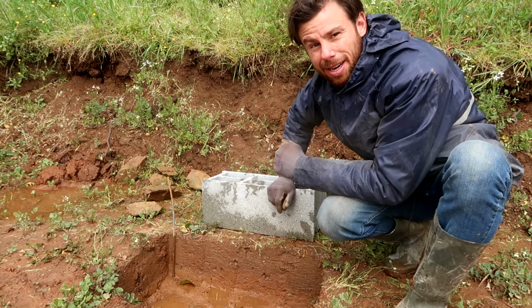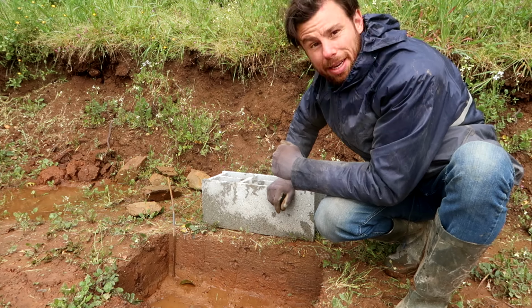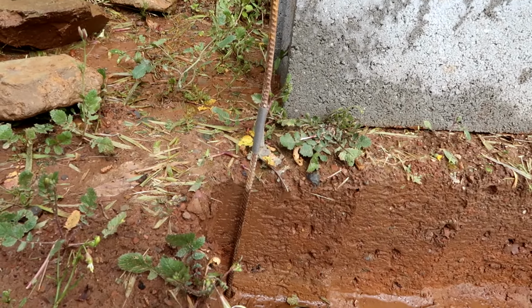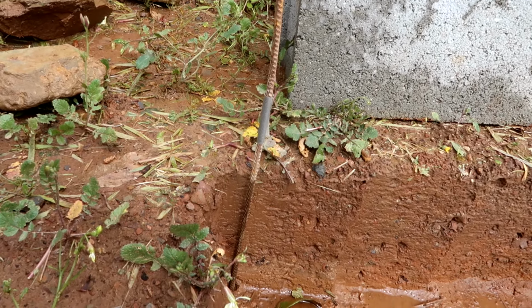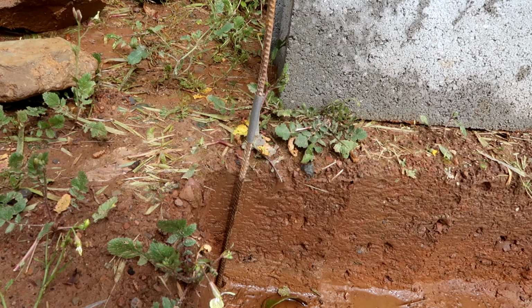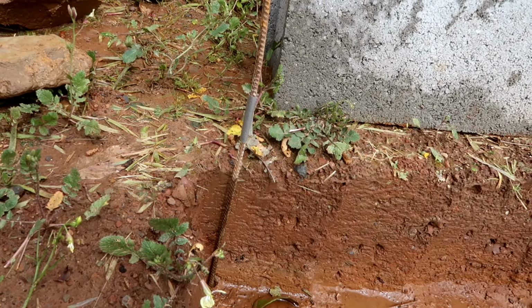But first, before we get started, I need to put some roping along the sides so I know everything is in a correct angle and in the correct height level. And to determine the correct height for the level, I've put these pieces of duct tape, and the bottom of the duct tape is about where the rope should be. And you know what? If I screw this up and it's not completely leveled, I can always put some fill plates between the concrete base that I'm making right now and the wooden frame that's going to build on top.